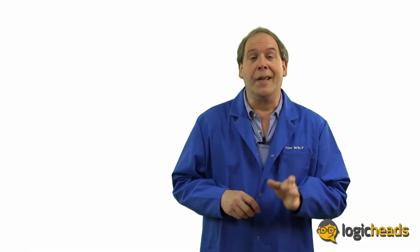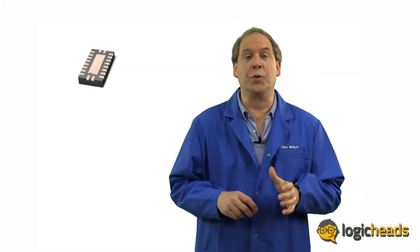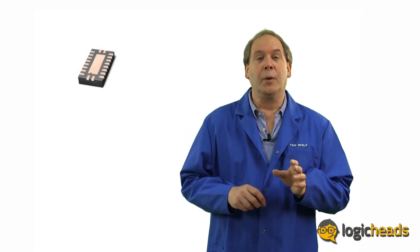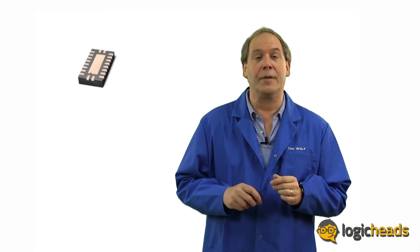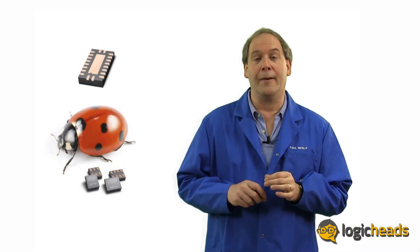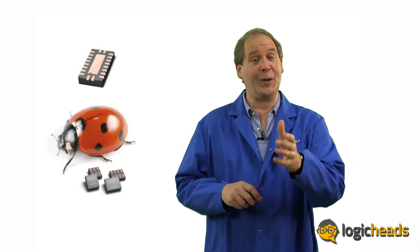So an even better solution is to get rid of the pins and balls completely and go leadless. This is called the QFN Package, or Quad Flat Pack No Leads. The connection pads are as close as 0.4 millimeters pitch, which is about the smallest that most assembly machines can pick up and place. You can get a lot of pads on this package, up to 60 pins in some configurations, but the outside of the package is still only a few millimeters on a side. This sort of brings a whole new meaning to the term 'computer bug,' but in a good way.